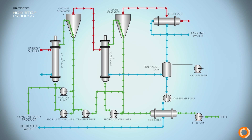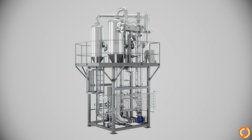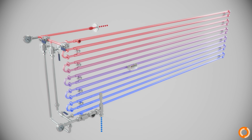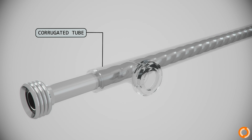The hot energy of the condensate water is used to heat up the incoming product. This way the product's temperature is brought closely to the evaporation temperature. A concentric tube-in-tube heat exchanger with corrugated inner tubes is applied. The corrugation profile creates extra turbulence and breaks up the fluid boundary layer, resulting in higher heat transfer rates and a better resistance against fouling.